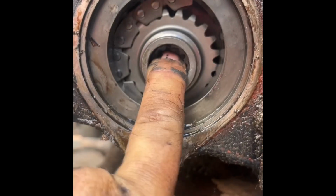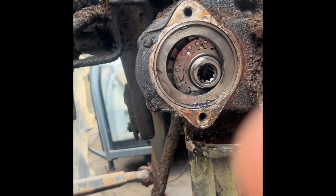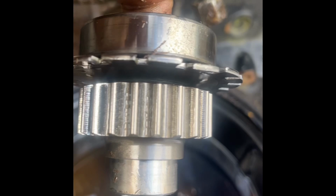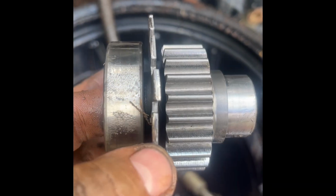If you see the exciter wheel that's in there, that's too big to come out this end, so you slide her out the rear, except the chain is caught. Yeah, I'm gonna have to try and prise that chain off, so I'm gonna have to put you down, guys. Just get the chain off the teeth internally, and then you can pull out the drive gear with its exciter wheel, which is bent. She wasn't showing revs properly anyway.